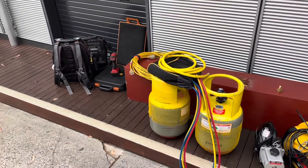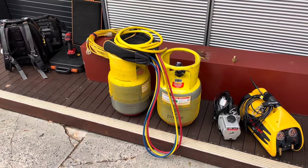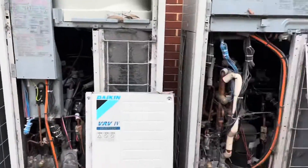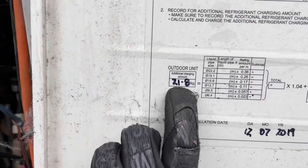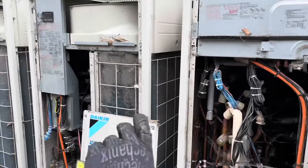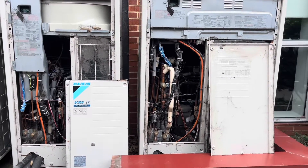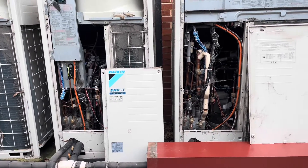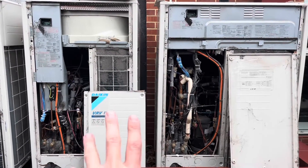Look at all the stuff you've got to bring out of the car when you do jobs like this. I've got another 20-kilo pump-down bottle as well, just in case — I have a feeling we're probably going to need it. We've got our pump-down bottles on vac at the moment. Pulling the covers off to see how much additional charge they've added: we've got 21.8 additional. This one here holds 11.8 and the other two are 2.9, so we're definitely going to need that third bottle. After using the calculator on my phone, worked out that we've got roughly 54 kilos of gas between us, so we're definitely going to need that third and potentially even a fourth. Now we're going to put these VRVs into recovery mode.